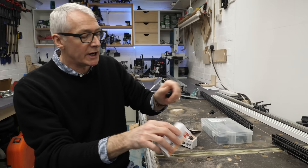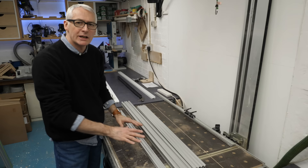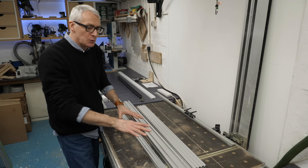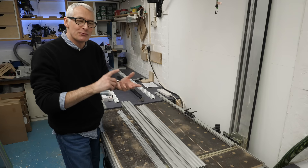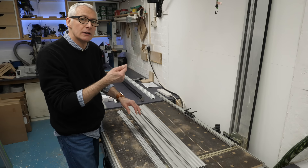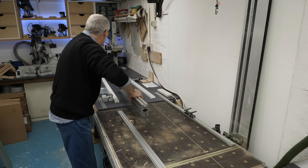Let's recap quickly on extrusion. We've got 40x80, 80/20, and 20x40 — we're not going to use any of these. We're going bizarrely with IKEA curtain track and regular T-track. But if all you want to do is build a frame, any of these will work. If you want a frame that takes guide rail clamps, you want an extrusion with an 8-mil slot — as far as I know, any extrusion with an 8-mil slot will work.